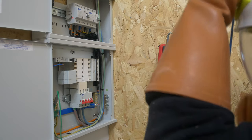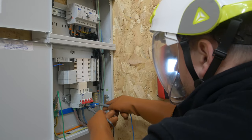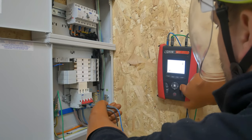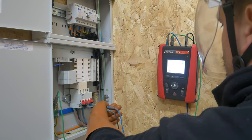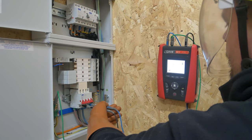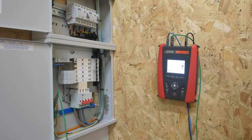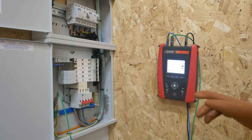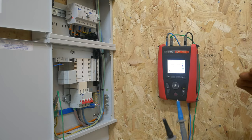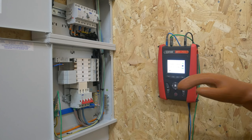We'll repeat it now for L2 and L3. You can see the voltage is present again — it's thinking about it, taking those three little measurements and then it will produce an average. On this one you can see a little bit different: 0.34 and 0.40, but it's marginal. Obviously these have a wide tolerance on the test instrument, different terminations running through the isolators — there are lots of different things at play. It's not going to mirror out precisely the same; you're just looking for it to be consistent.